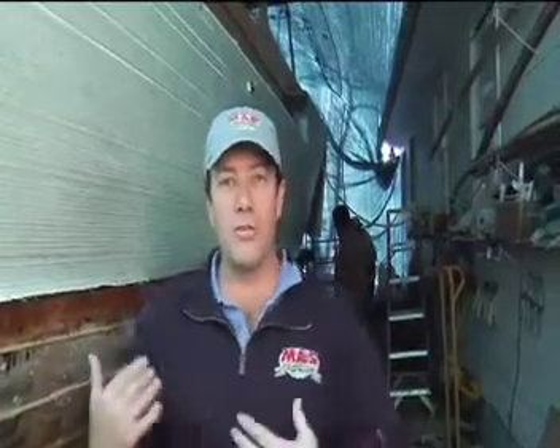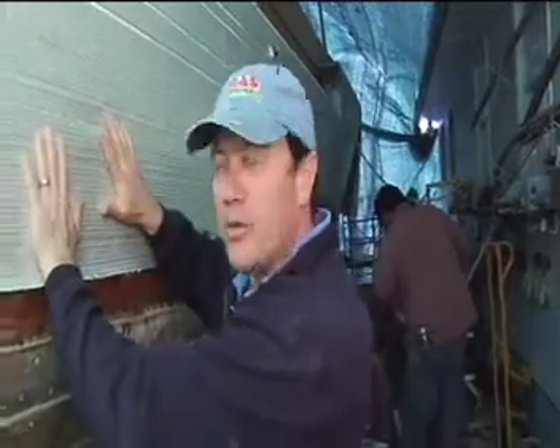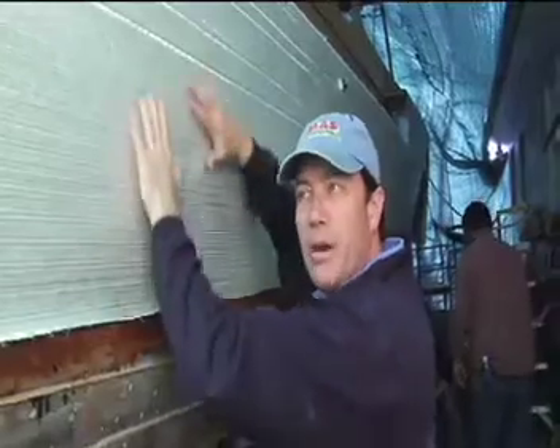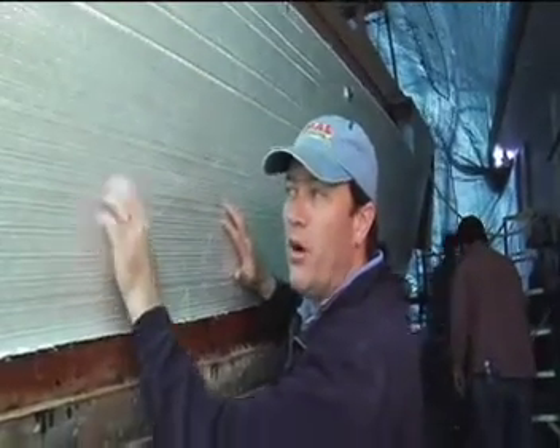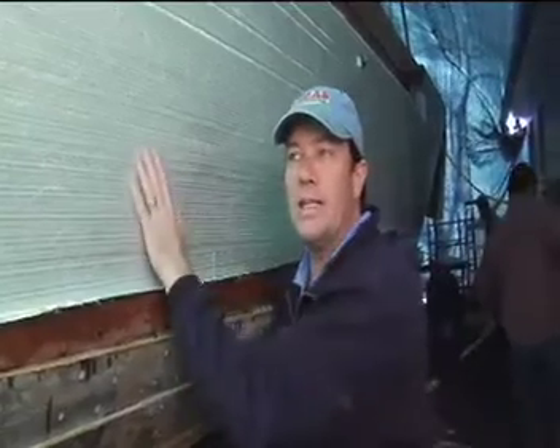We've gotten to the point where Mark's gotten us through to the second coat of glass on here. We'll finish wetting this out, and then what we're going to do is take some phenolic micro balloons, mix them in with the resin and hardener, and create a slurry of material. That slurry is going to be a little bit wetter than pudding. We're going to put it on the surface here and squeegee it out to fill in all these little imperfections, just nice and light. That slurry of phenolic micro balloons will make it a really nice, easily sandable surface.